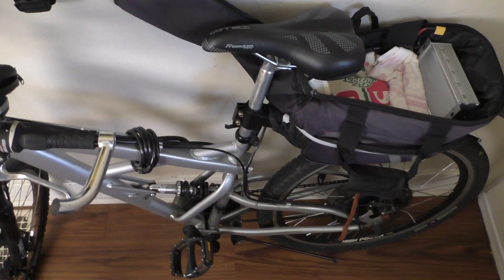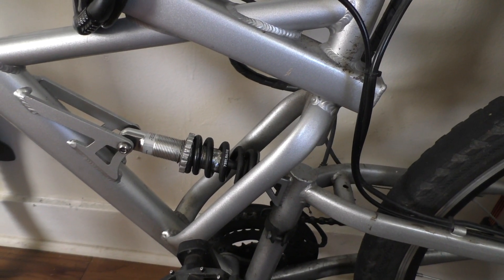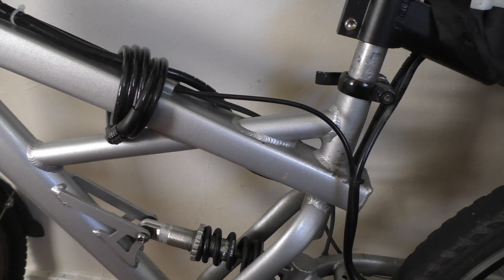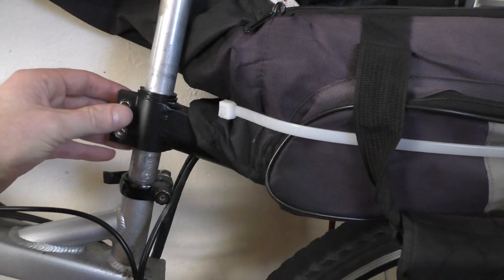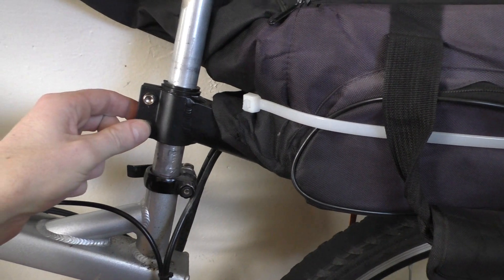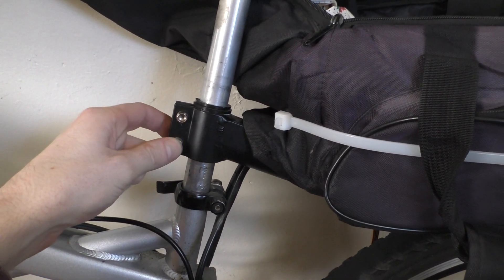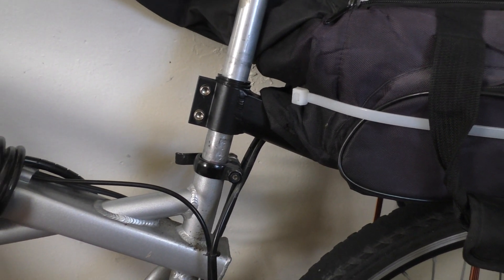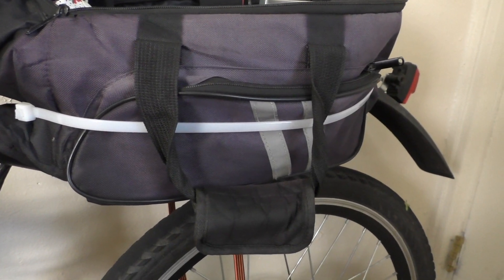The only other modifications I've done since my last video is raising the rack about an inch and a half, which gives a little more clearance above the rear wheel. That lets me soften up the suspension a little bit for a smoother ride, and I don't have to worry about the rack touching the tire. The lighter pack is also nice because with the SLA battery the pack would swing a little bit, but now that I'm almost 20 pounds lighter I don't have that problem at all.